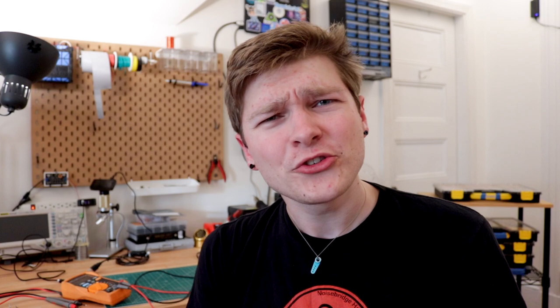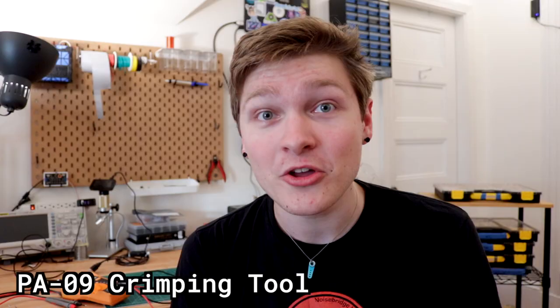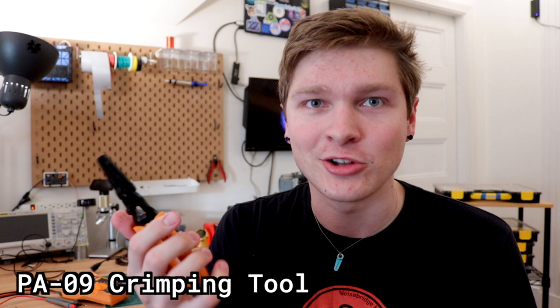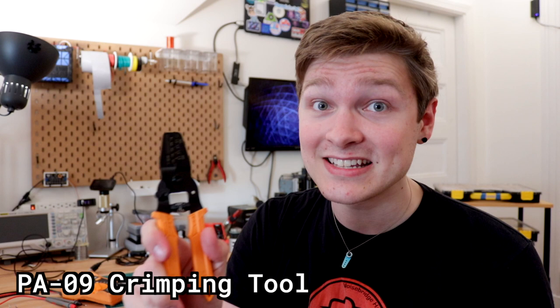Also in line with those are engineer crimps. I love using the Molex SL family of connectors, but the actual crimping tool for those is literally like $200 — just insane. Instead, you can buy these engineer crimps for around $20–$30, and they crimp Molex SL along with JST connectors and a whole bunch of other crimps. So if you're getting into crimping and cable harnesses for your boards, getting a set of these is really helpful and way cheaper than the Molex brand ones.